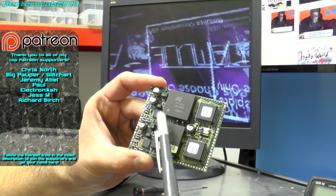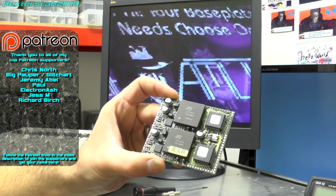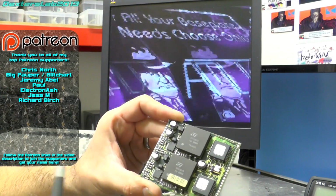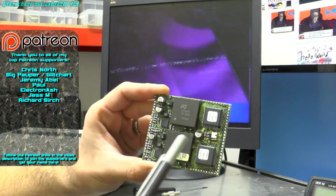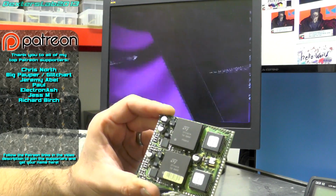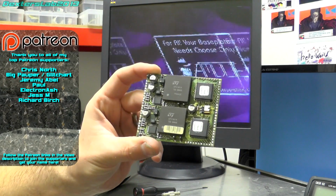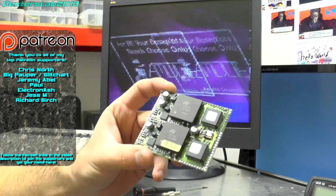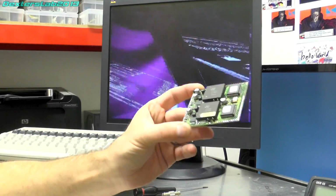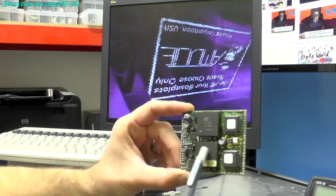These ICs were actually made by Sony originally, back in the day, called the SPX 1601. I think Sony sold the design to ST Micro, and they started making them under a different model number, STV1601. Now these chips were notorious at the time for going bad, and I think that's basically what's happened to this Ramcorder.